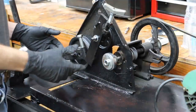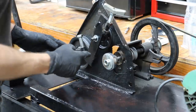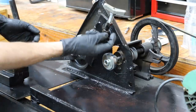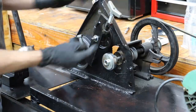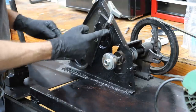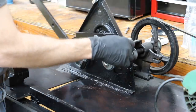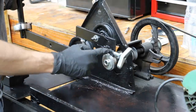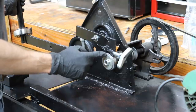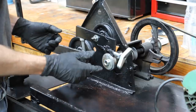So just how well does WD-40 lubricate? One way to determine this is to use a lubricity tester. The way it works is I insert a little bearing inside the bearing holder, and this race is going to spin at 800 RPMs. When I apply downward force pressure on this race, it's going to cause a lot of damage if the film strength of the product is poor. We're going to find out just how well WD-40 does regarding film strength compared to regular motor oil.